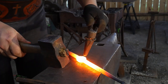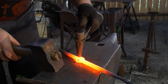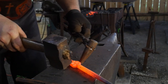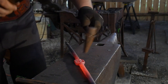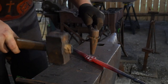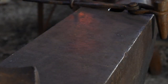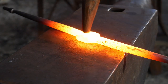Next up we continue with our little 3/8 ball fuller and make our rosette on the actual knocker portion. You can see how I've taken one theme - one element - and continued that through the entire piece and the entire project. With some pretty simple tools you can constantly add these types of details into your work, and your work becomes very visually complex because you're layering one element at a time. That's really been a big key factor in getting to this point in my career: layering forging elements one right after the other on top to create a whole project with simple tooling.